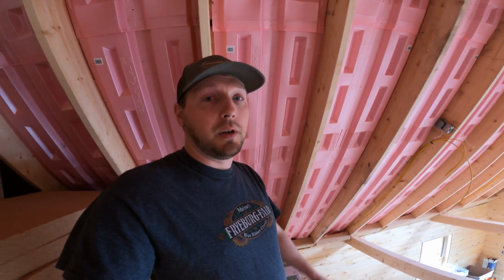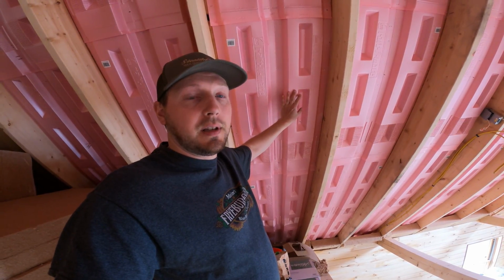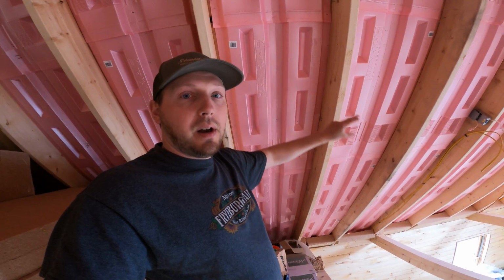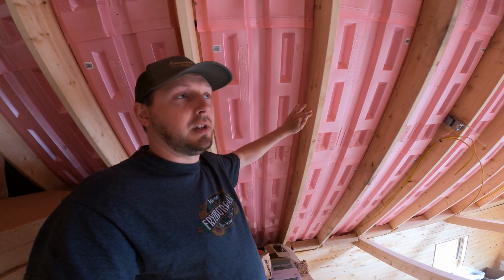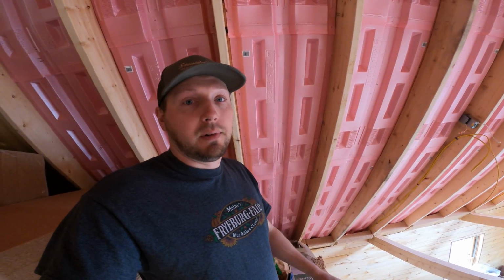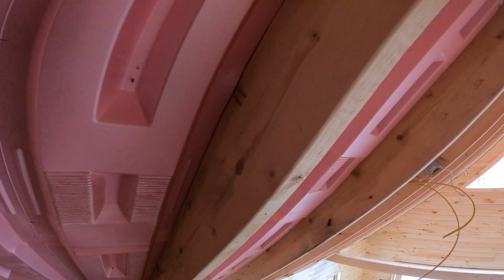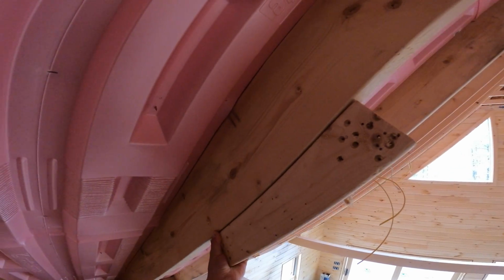And so what we're going to do is put in the 6-inch insulation, which is actually 5.5 inches. And then we'll build out our rafter with the 2x4. And then we'll put in our 3.5-inch insulation. It'll give us like a R36. And then we should be able to put our pine on right over that, no problem. Put 2x4s on end like this. Screw them right on. Basically make it a deeper pocket to put our insulation.